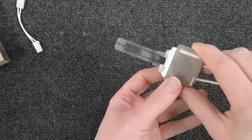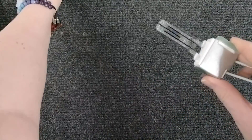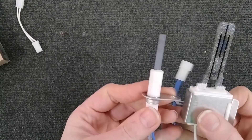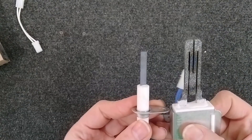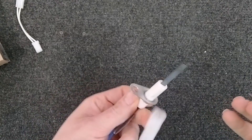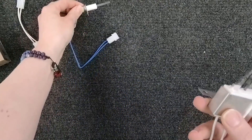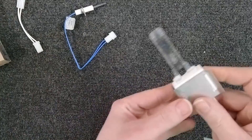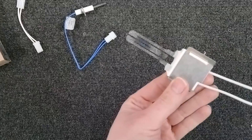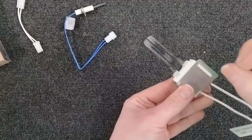The differences between these two is not just the texture — the material the carbide is made out of is actually more fragile than the nitride, and you can really see the difference when you put them alongside each other. I'm trying my best not to break these things. The carbide is very fragile; the nitride not so much — they're pretty sturdy. The number one reason carbide igniters come in during the season is people mistake them for flame sensors, pull them out, tap them against something, and they shatter.